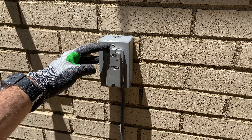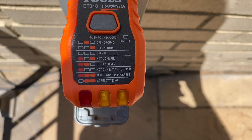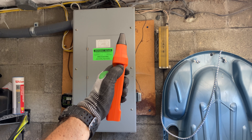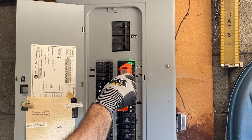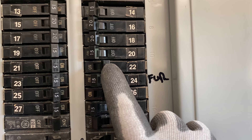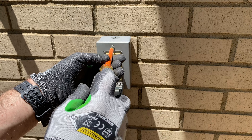Here's a question: how do you install a new outdoor GFCI outlet? This old one really wasn't great, but I tested it to make sure it was wired correctly, and it was. Then I used this Klein Digital Circuit Breaker Finder to help find the breaker that the GFCI is located on. It'll turn red and beep at you. I turned off two breakers because I wasn't sure which one it was, and then I tested with the voltage tester to make sure it was off.